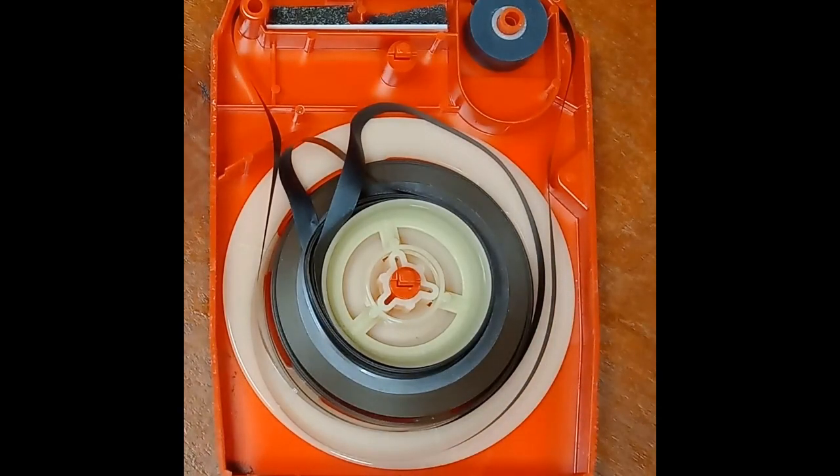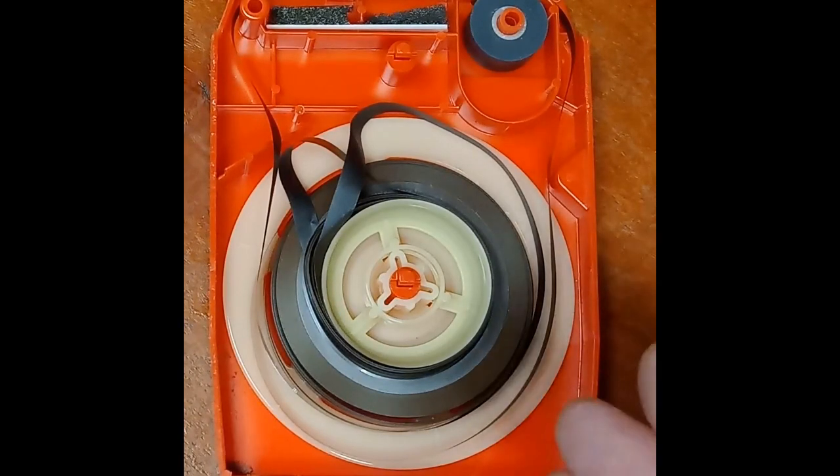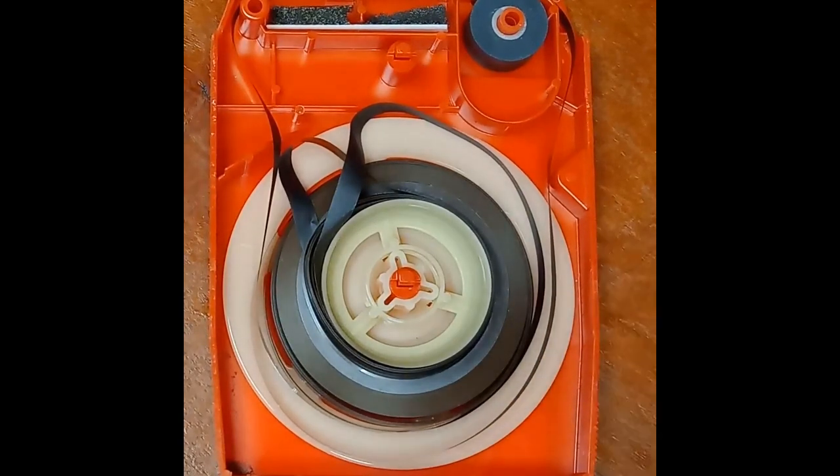So anytime you get a new old stock tape, I would say the only exception to this could be the RCA styles, because of the way that the tape is routed inside of those cartridges. They don't typically have the issues that some of these other ones do, like this style. This is a TC8 two-tab cart. In 99.9% of the cases, with the exception of possibly the RCA carts, in which case, oftentimes the pads will fall off if they're the foam felt style ones. So you've got to watch out for that.